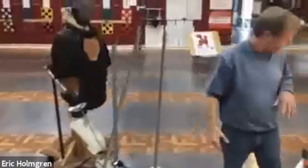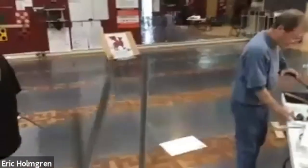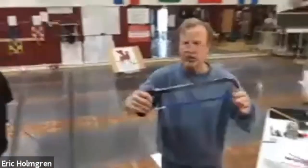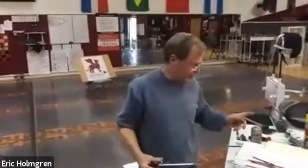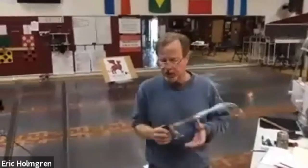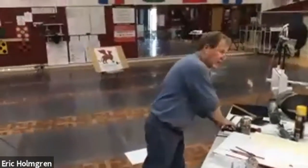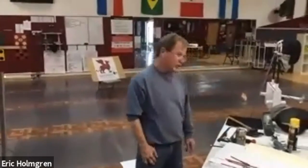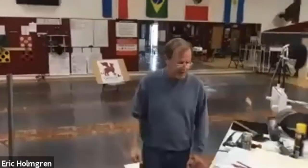Something different was done with the back piece. How do you cut steel conduit? Use a hacksaw — that's the only other tool absolutely required besides the drill with the appropriate drill bits. I don't think they'll cut the steel for you at the store, and they don't have a big machine to do it, so you pretty much have to saw with a hacksaw unless you have a bandsaw.